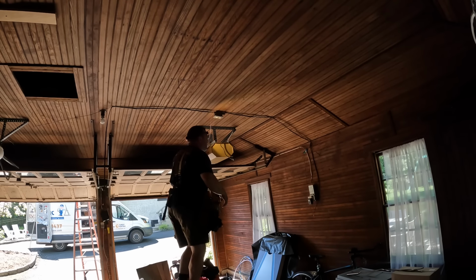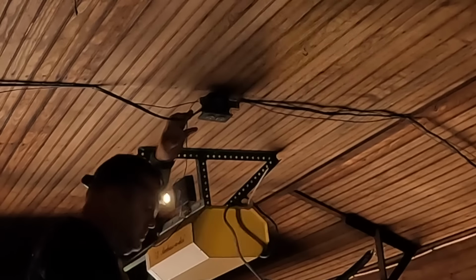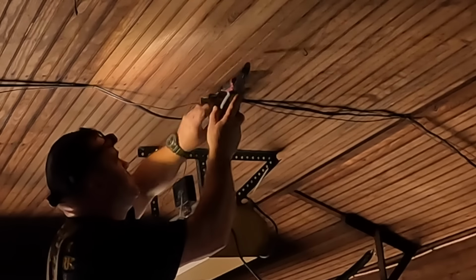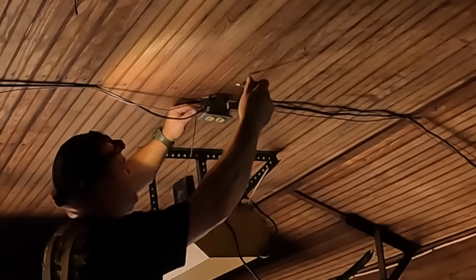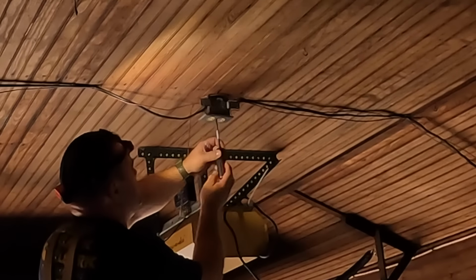At this point, I was still under the impression that the supply came out of the ceiling, but as it turns out, the knob and tube supply for these receptacles that were put in later actually comes off the box on the wall that's all butchered up that you saw at the beginning of the video. And so now I'm trying to take this box off of the wood here without actually taking the receptacle out for time.